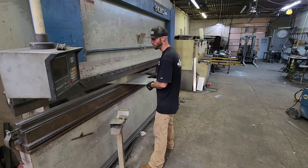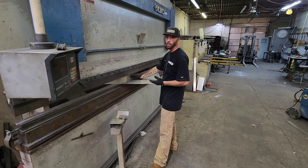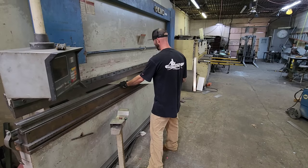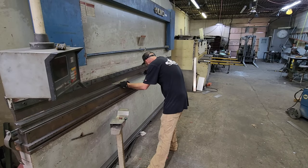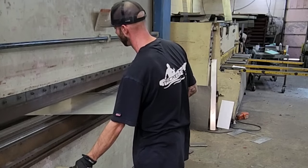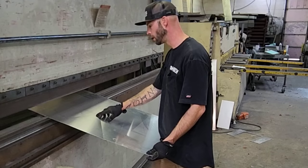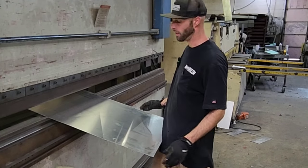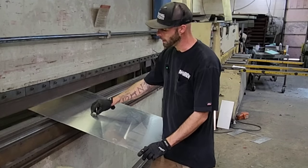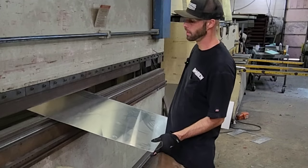It's not much of a cross bend, and it's really gonna be offset from our hole anyways, but it will still help the water drain. You see our hole is still 2.5 inches off, but it's fine. That little bit will just keep the water from pooling up in the corners, and I'm probably even gonna recess this down with a recessed punch in here, so it'll drain fine.